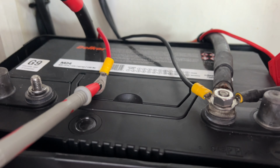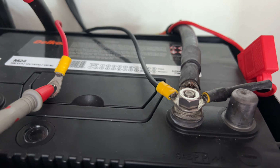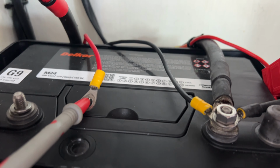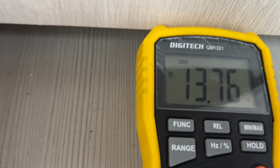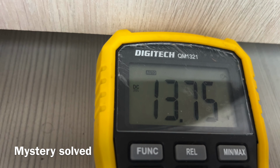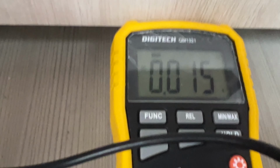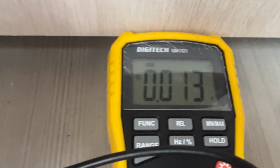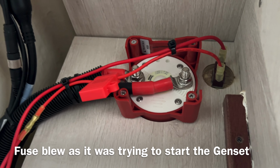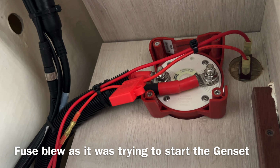Okay, right, so the battery measures 12.99 volts, but no guarantee that it can actually do enough current for cranking. So this red wire to negative, let's see if I've got enough hands. It's not easy down here. It's 13.75. So I think it's pretty obvious that this is a charging circuit from the AGM. And I flicked the switch by the battery isolator and we've lost voltage. So obviously that switch is for the charging circuit. On the back of the switch, there's the battery switch, there's the fuse that blew. So I think the fact that it was working overtime blew the fuse.